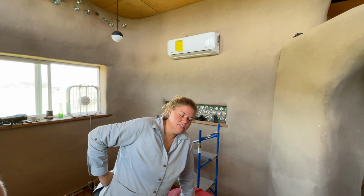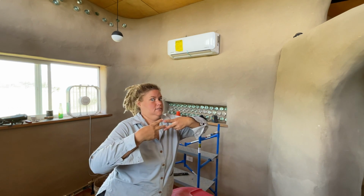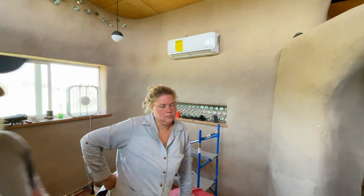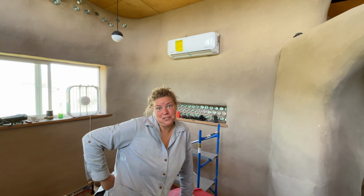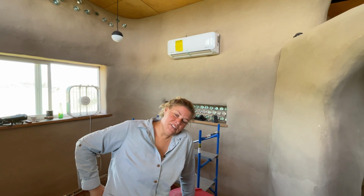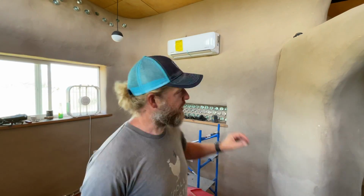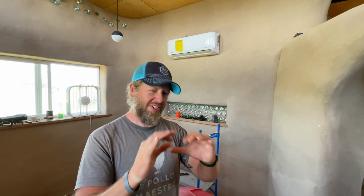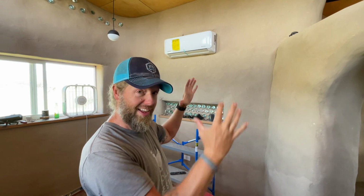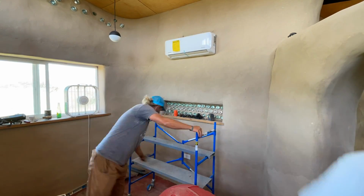Of course, we forgot to put the sealant on the copper connections, the flare fittings. So we're going to take this down and put the sealant on, re-torque it, and put it back up just to be safe. Also, we noticed that the hoses are putting just a little bit too much pressure on the right side of this, so it's not setting down level. So we're going to move the bracket up just a little bit.